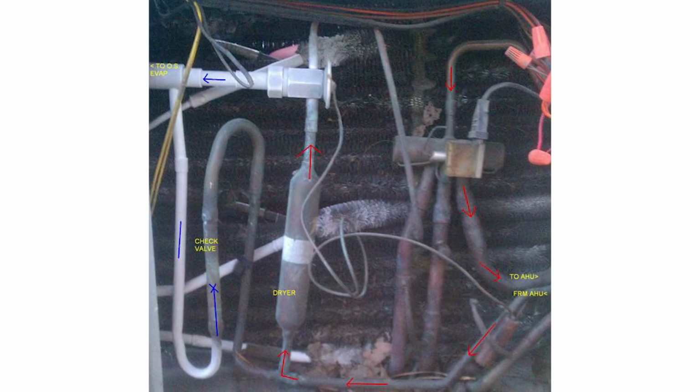So for you that don't know, and you've always wondered, hey, what is this little weird tube that's kind of bypassing the TXV? What's the point of that? How is this even working? It actually has a little check valve. Based on pressure, one direction it forces it closed, cool mode on your indoor side, forcing the refrigerant through your expansion valve. In heat mode, it forces the little pin the other way, allowing refrigerant to flow through. So it's pretty cool. It's weird looking.